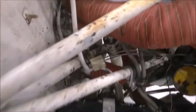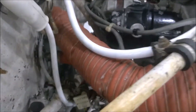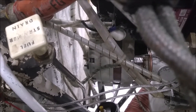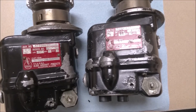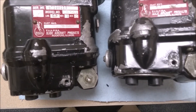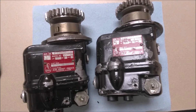This one's a little tighter because the scat tubing's in the way, but it comes off the same way. See the P lead's way down there - I'll just undo that. I'll get it from this angle and get it off and then take the mag off. There's the mags - I got both of them off. The right one's harder than the left because of the confined condition it's in. But there's where the P leads connect and your ground right there. The reason why I took them off is I'm going to replace some internal parts.